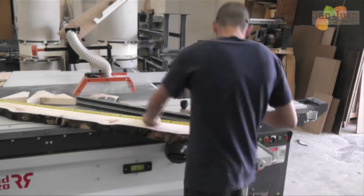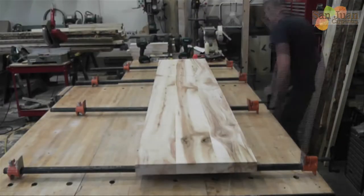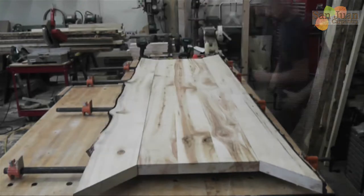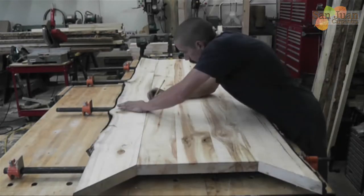It is so incredibly important to cut it exactly perfect, which is a tough task when you're dealing with the inside edge of a mitered board. If you weren't doing a live edge board, you could use the outside edge, but that's not an option here.